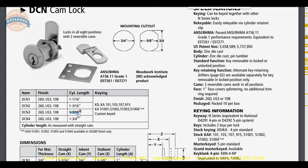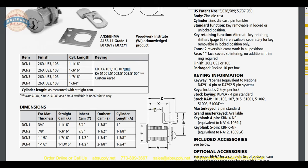Other lengths are obviously available. On keying: I have a customer interested in ordering one today and then ordering more with that same key code later. We can simply pick a key number — this lock is a 915 — so you would specify DCN1-2060-915 to get what you need. Cylinder length as measured with the straight cam: I am accustomed to it being from the underside of the head to the outside of the cam, but this spec is from the underside of the head to the inside of the cam, which is dimension X on the cut sheet — and indeed that is the case.